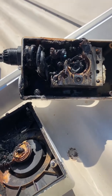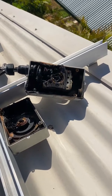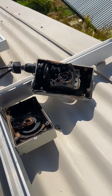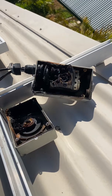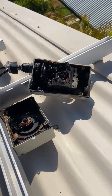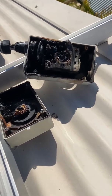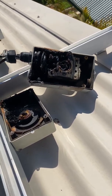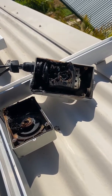This is a big cause of fires in Australia, and it's not really a fault of the product itself — it's usually caused through either water ingress into the isolator causing a short circuit, or not being terminated correctly, and it starts a fire. Luckily this one stayed within the isolator and didn't actually catch fire — it's just been smoldering away.